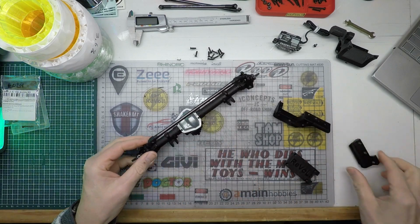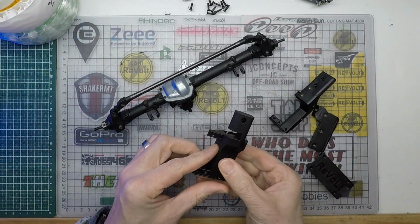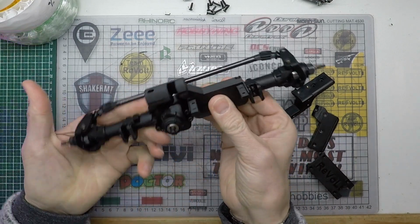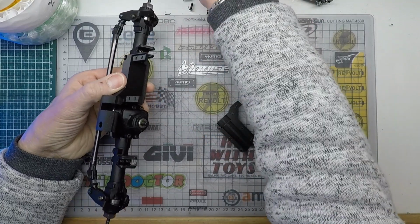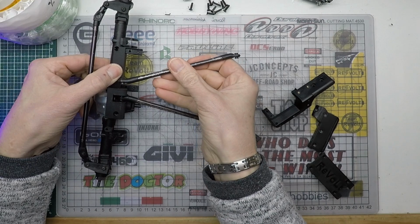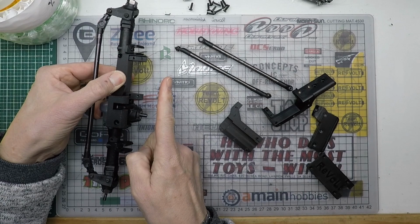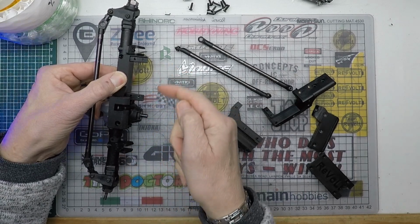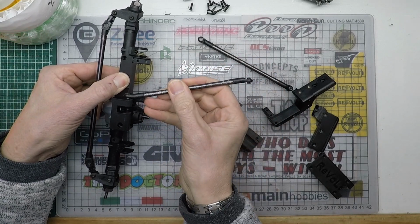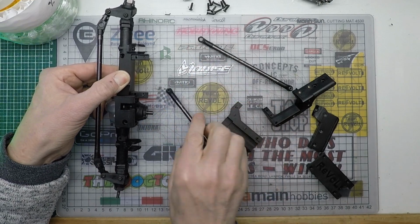Not gonna take you through the whole process again, but let us say that this was on here, something like this, which led to the fact that the upper links had to leave in here and over here, but there is no room because somewhere over here is the gearbox. The spur gear is somewhere over here, so there is no way this link can move, or this link, they cannot get around that part.